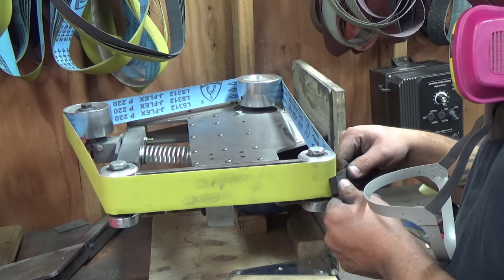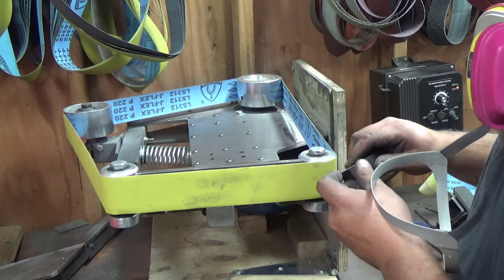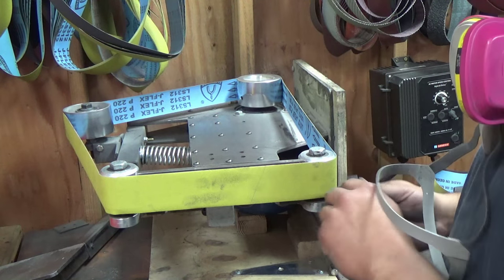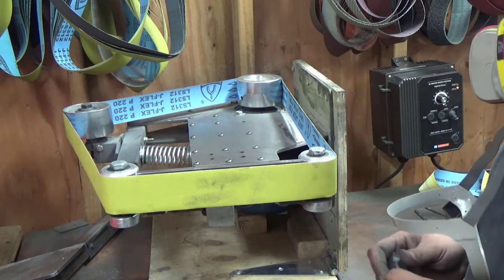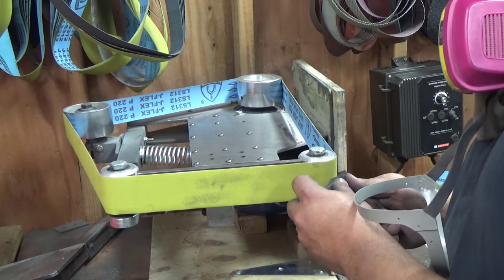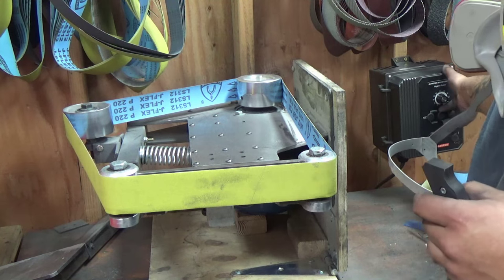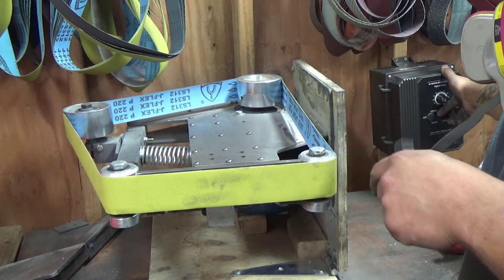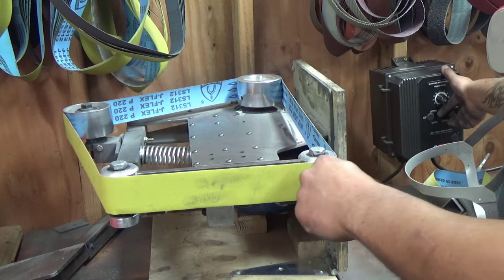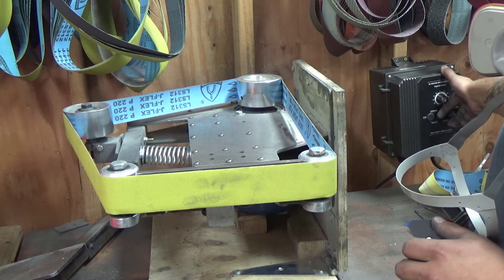Now, that's the helpful thing of tilting a grinder on its side. Now, when it's upright, you can still do it this way. It's just a little awkward of an angle. So if you flip your grinder on its side, I'm telling you, this is just like grinding a blade. It's so much easier. Now, all right, I'll show what it looks like. This is a 220 grit belt, by the way. This is what I'll use for hogging it out, and then I'll probably switch over to a 400 or an 800.